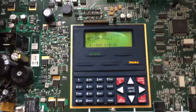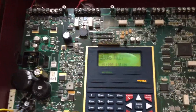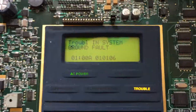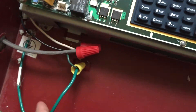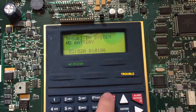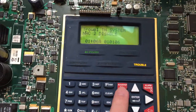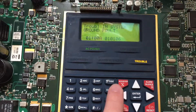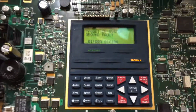I have a couple devices hooked up, and I'll show those devices and then do a test. First of all, these troubles — I have a ground fault on this, not because I don't have it grounded, which I do, but because unfortunately NAC2 on this panel is broken. Then no battery, obviously don't have batteries hooked up, and NAC2 disable because I just went ahead and disabled it as well. So we have those three problems, and that's pretty good.